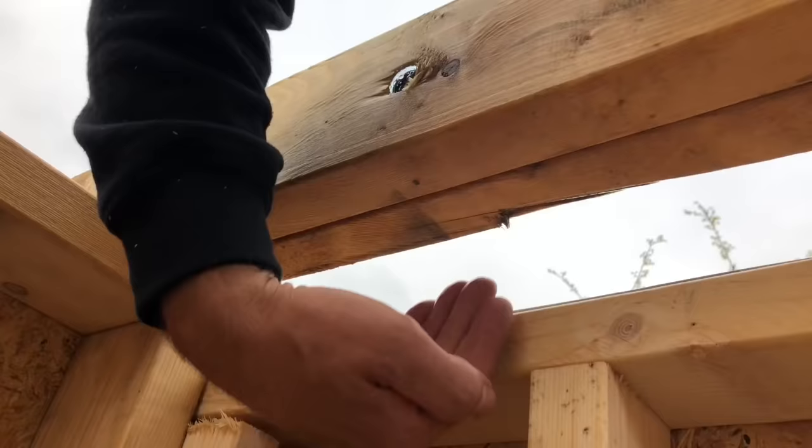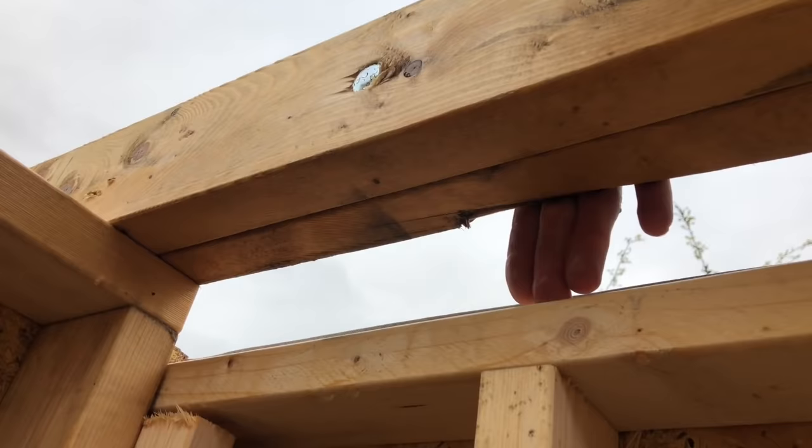So when we plasterboard the wall, there's something fixed there. I'll get Adam to go inside and show you now, and it might be an easier video. Right, so this angle might be a bit better. If you imagine the plasterboard comes through now, and it will butt up to the wall there, because we're going to put a timber there on that wall. When we plasterboard there, we can fix to that, and this one will butt up to there.